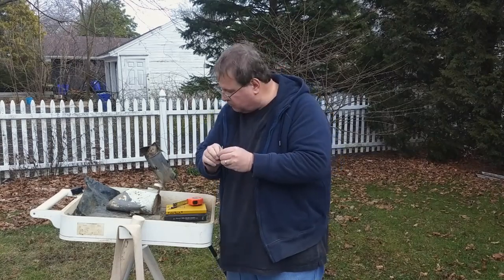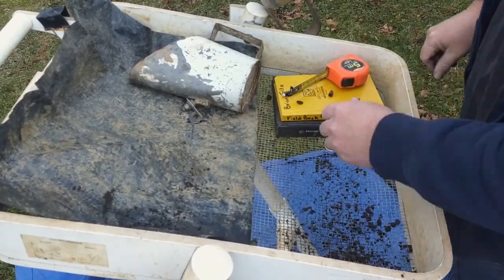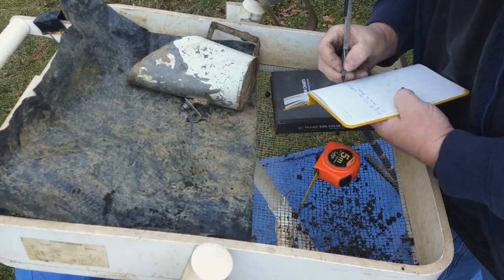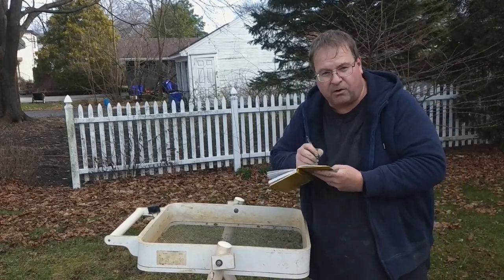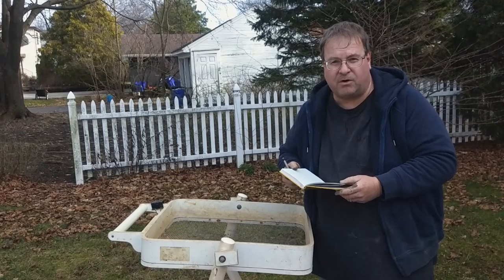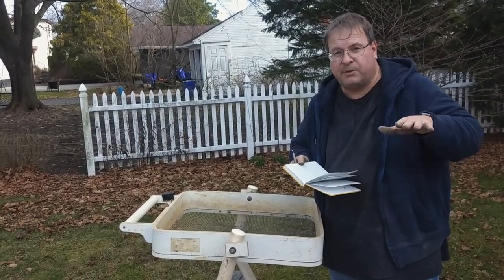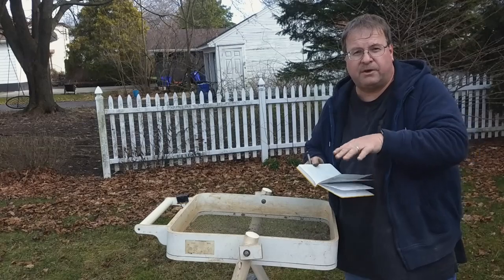Here I just found a little wire nut. That seems to be all there is — just a wire nut. I'll write that down in my field book. I also record notes of where my auger holes are located on the project area. I will usually GPS the location of the auger hole. Sometimes, if we're looking at soils in different river terraces, we'll use a total station to get a really accurate location of the auger holes so we can compare the relative depths of each auger hole in the soil layers — it's a way of correlating soil layers across the project area.